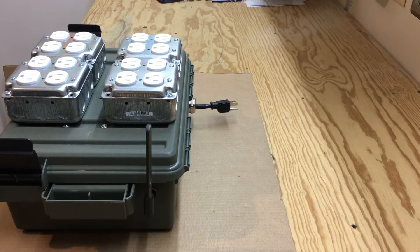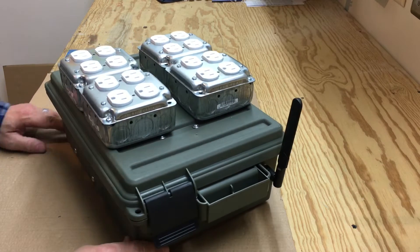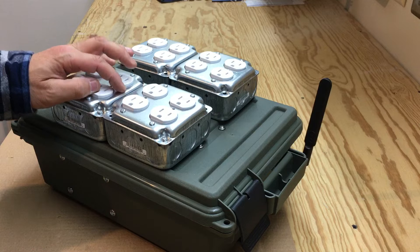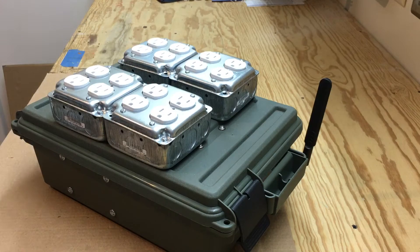This is my Raspberry Pi Christmas light relay setup — I'm almost done with this. I figured I'd do a video. What you're looking at here is I got four dual-gang boxes with eight receptacles, and I had the hot side cut on each receptacle, so each one has a different plug.